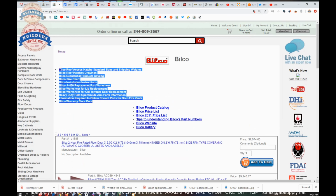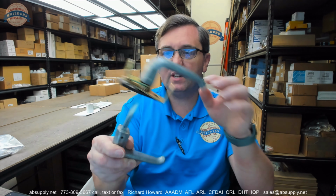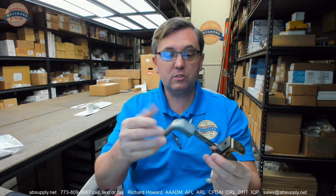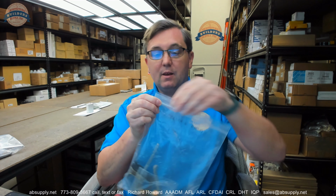Let's wrap up this video on camera. Okay, so the point of this video is just to provide some visual evidence of the item. If you have a Bilco roof hatch and you're needing a replacement handle, this is 90% of all the ones that you'll sell with the 4 5/8 shaft length. So be mindful, it's probably this one. But the dimensions are here to help assist you and determine whether or not it is. And if it's not, meaning the shaft length is too short or not the right length, that link to the drawing there will allow you to get the part number so you can populate that back into the site and then move along.